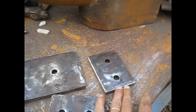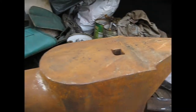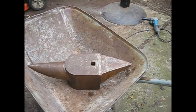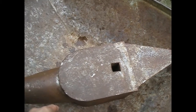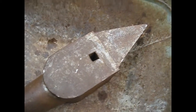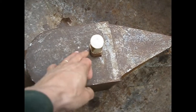The feet are ready. Now we only have to clean the anvil and lay the hard surfacing on top. It's time to clean the face — remove all the rust — and lay the hard facing layer. I've arranged a plug of copper to plug the hardie hole while I'm laying the hard facing.